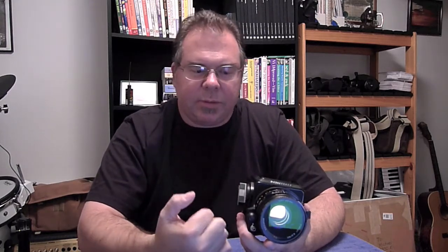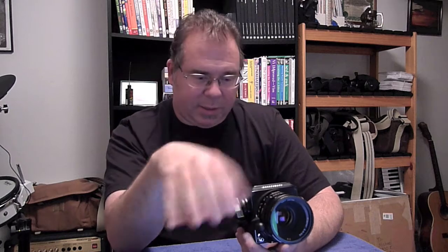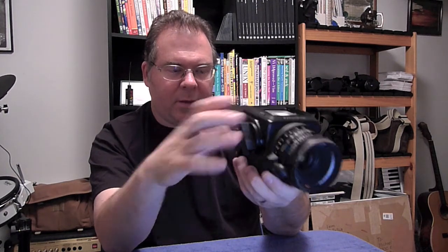I'm going to remove the prism — it just slides right out — to make the camera a bit easier to handle. Now with the camera half apart, I want to do what I call a light-through test. We want to make sure everything works from the lens through the back, and test that the aperture shuts down properly and that bulb works. I've got the camera cocked, I'm going to choose the smallest aperture, hold the camera up to a light source, set the shutter to bulb, open the shutter, and make sure I see light coming through the front of the lens with the aperture as small as possible.